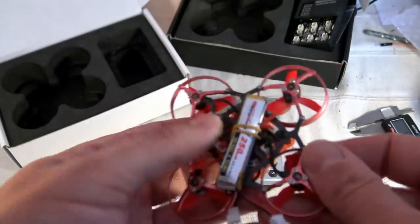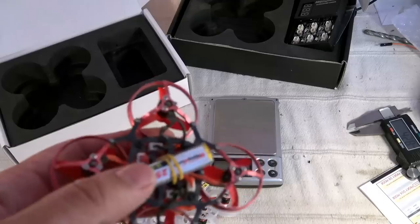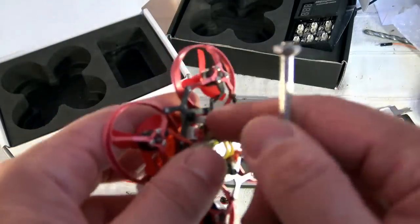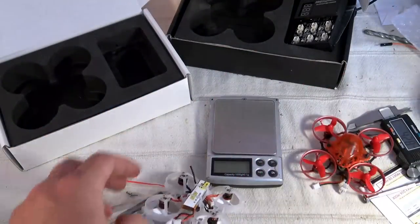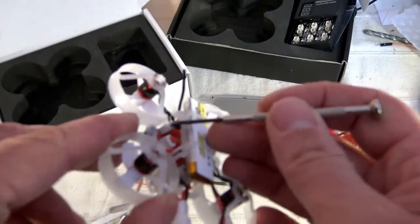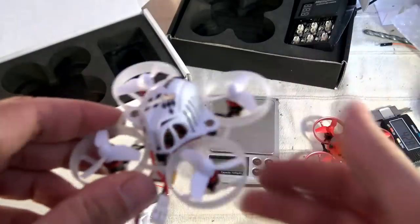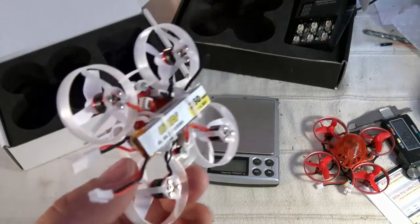Sometimes I observe that one motor isn't starting, and usually you have to play a little bit with the connector, bend the wires a little to let the motor spin one more time. So it can happen. If it happens, do the same with the UR65: play with the connector a bit, or reboot the board several times until the non-working motor is up again.